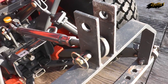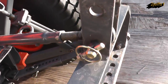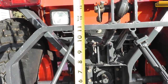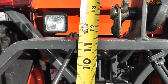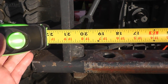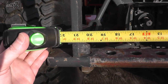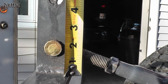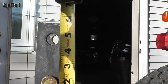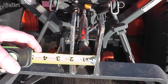The upper brackets are also two inch by quarter inch thick, with three-quarter inch holes in them. It's 11 and 3/8 inches to the top. The inside dimension is 20 and 3/4 inches, and over the outside the first hole is at 1 and 5/8, the second one at 4 and a half, and to the very top a tad over 5 and a half inches. One and three-quarter inch ID on them.